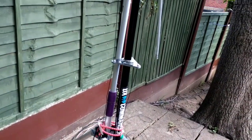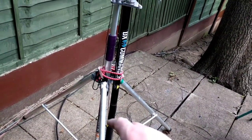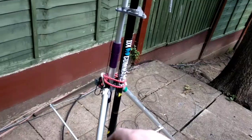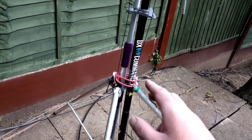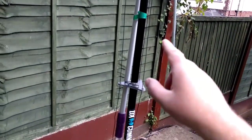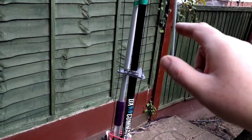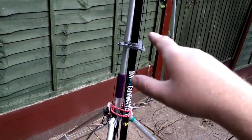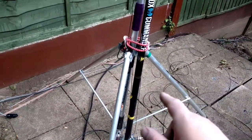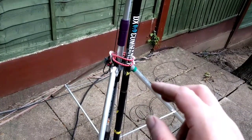So I can get the lengths right — that's my first attempt at cutting the lengths. At the moment, 40 and 17 are in tune, 10's in tune. So I've got 40, 10 and 17 without the use of an ATU. But if I stick this through an ATU, I can get 20 as well as 6 as well. So that gives me 40, 20, 17, 10 and 6.